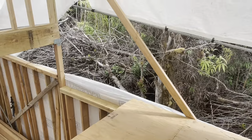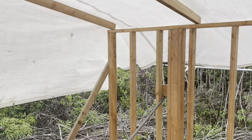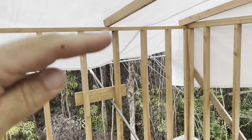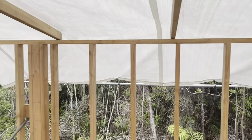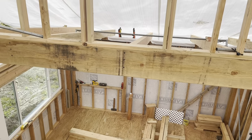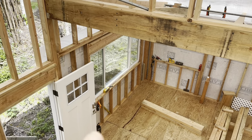It goes very quick on these walls because they're small. I'm only doing the 6 foot height because that's what this back wall is. So I'm just matching everything so that I have a continuous top cap and double top cap all the way around on all of these sides. And then from there I will build up, which now that I think about it, I don't think that I actually showed down here. Let me go downstairs.